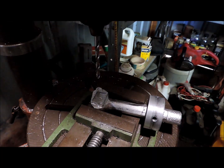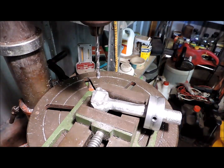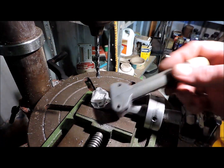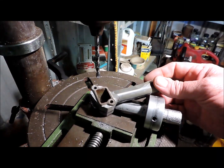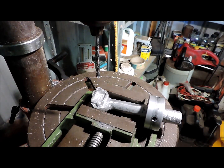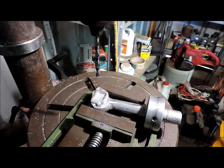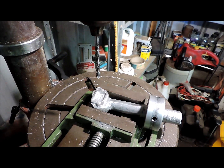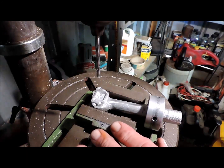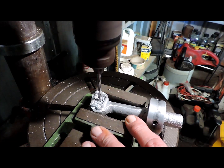I have the manifold mounted in the chuck. Trying to get this light right is very difficult. I need to make the start of the cavity here — it's about 13mm deep. I'll start this and then put a 10mm drill in and run it down about 9-10mm. That should give me a hole that when I cross drill through there I can see if everything works out that the aim was correct. So let's first put a small hole in here. I've got the machine going slow mainly because of the cross drill coming up.